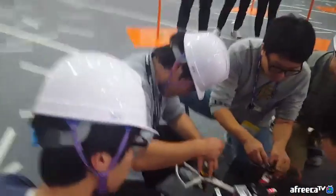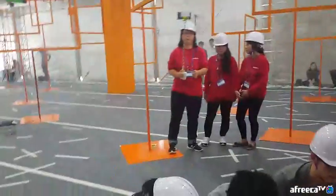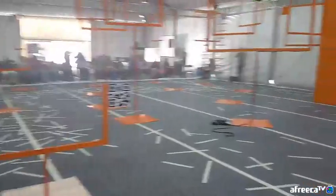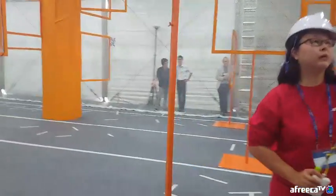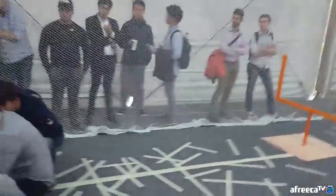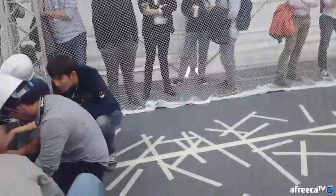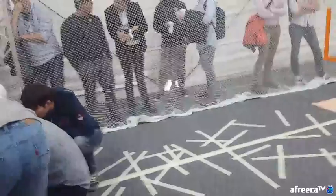Yeah, what kind of practical applications do you think could be used with the Coanda drone, for example? So the Coanda drone has a great advantage that it has a vacant space inside. If you look at the quadcopter robot, there is not much place you can place your robot arm. If you put the robot arm below, then when it catches something and sticks to something, it becomes an inverted pendulum. So it becomes dynamically unstable.